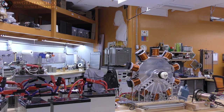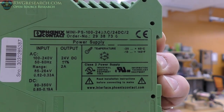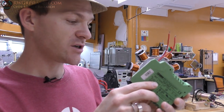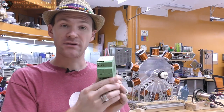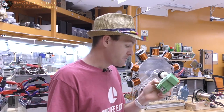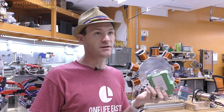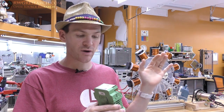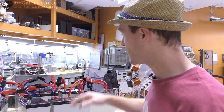I've connected these power supplies — I have one on hand and got a few more. These are about 88% efficient, made by Phoenix Contact. They are 24 volt output at 2 amps, adjustable from 22.5 to 28.5 volts, which is perfect for getting over the voltage we need. DC input accepts 90 all the way up to 350 VDC, or you can do AC. The higher the voltage the less amperage it uses and the more efficient it is. I've been running it around 260 volts. Let me show you on the other side how I've got these connected.